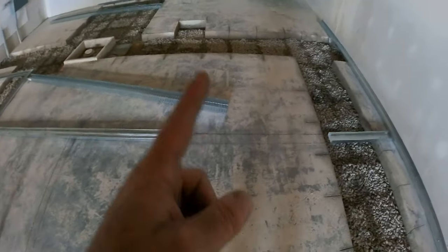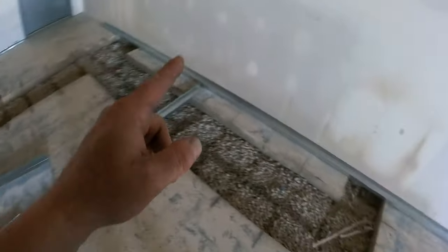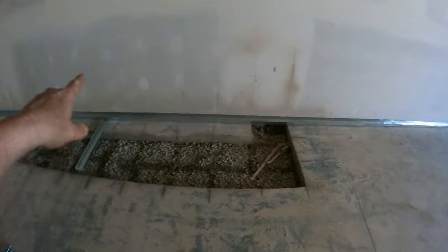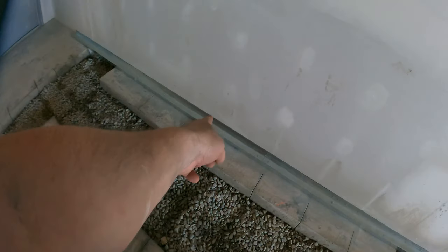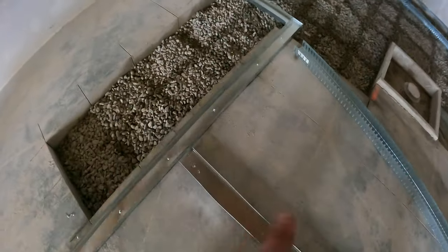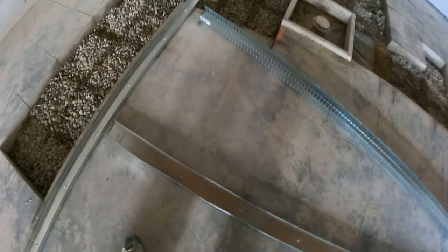As you're coming back doing top track, cut your headers. Now I'm going to start laying out my 16s, then put the top track and start cutting it. I'll cut the top track to tab over to that wall and cut a header there. I'll also cut a tab on this side to go over this wall at the top as well.